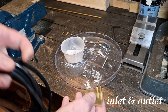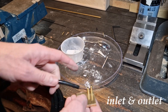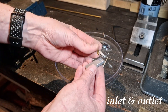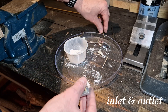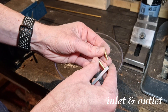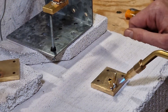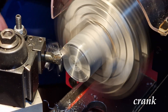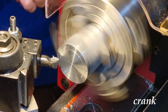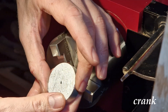The problem is that the tube I want to use is too thick to fit. I want to bend these small pipes and I came up with a solution that kind of helps: I fill the small pipe with a filler and then I can bend it. When I bend it that way it makes a better curve than if I were just to try and bend it, which would make kinks in it. I think it's good enough.